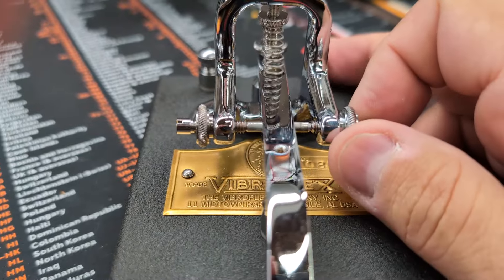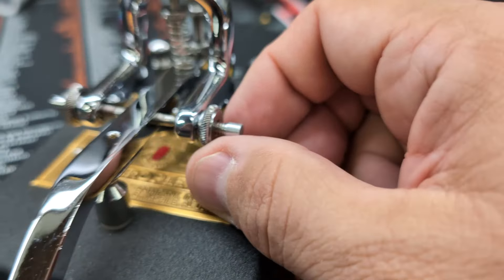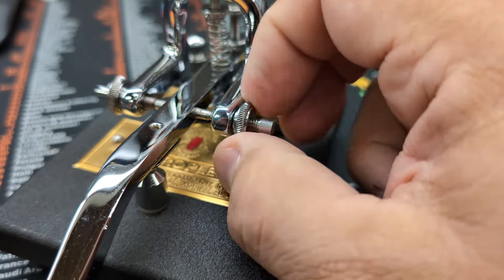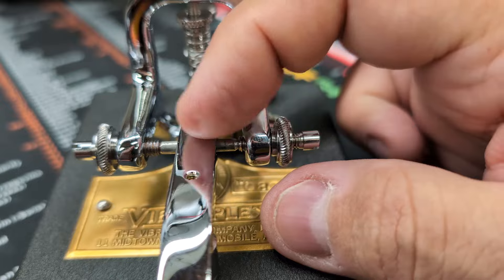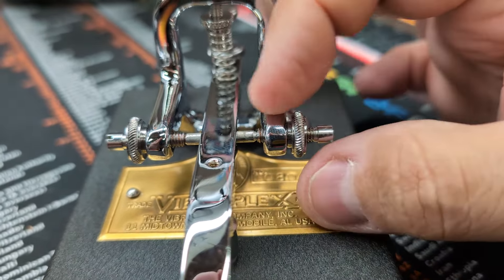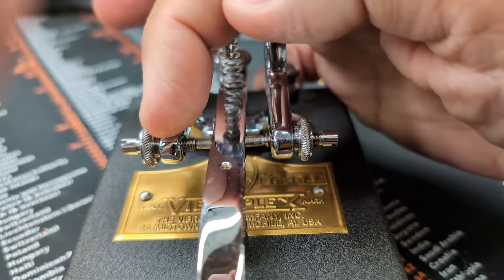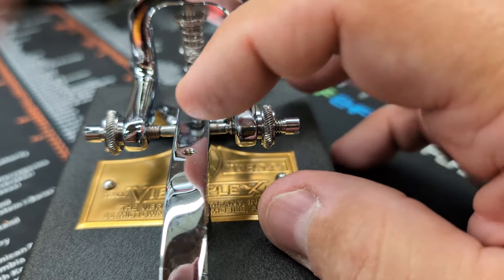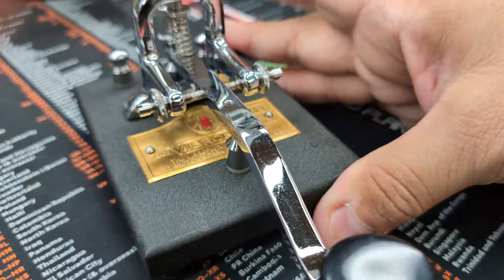There are some adjustments right here. Like a lot of the CW keys we see, even the iambic stuff, there's a locking nut and then a little screw-in piece that can create some tension. You can move it back and forth — back this screw out a little bit or push it in — so you can adjust where the bar sits so it's right in the middle of the slab.